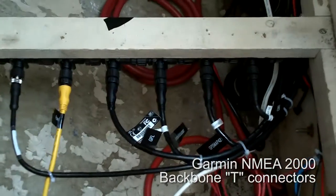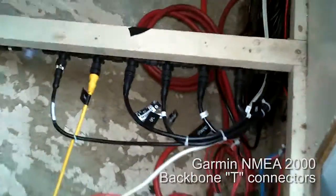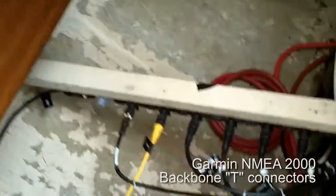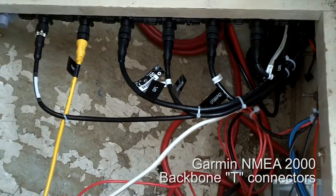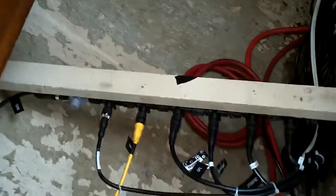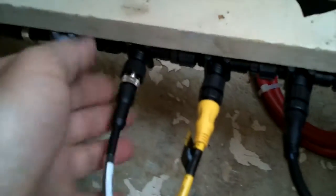Today is Saturday the 6th — I think I just got finished installing our Garmin system. This is the quarter berth right next to the electrical panel, and we installed the N2K T-connectors underneath that support bracket. We've got the Garmin wind system coming in here at the end with the gray lightning arrester.